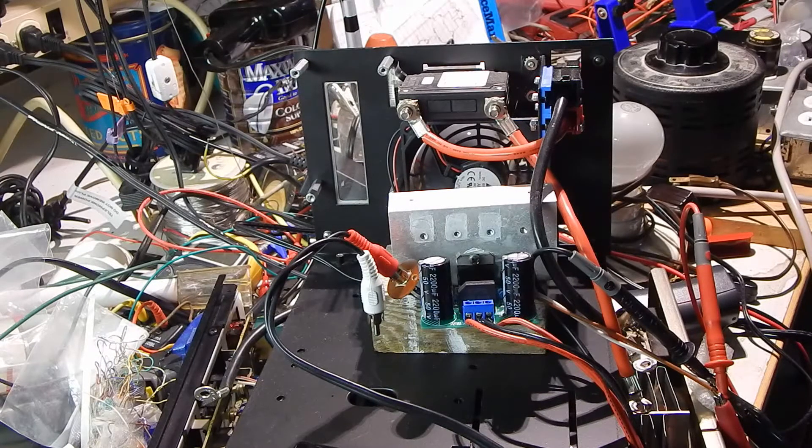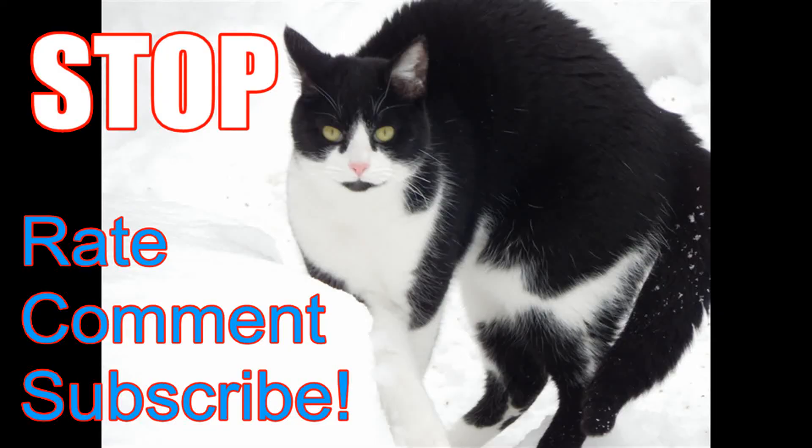That's what I get for not building that preamp project yet - need to do what John did and build a little test bench preamp for cases like this. But the amp held up well - it held up under duress, seeing almost 100 volts. So this chip is actually genuine and actually acts genuine. I don't know what happened with the other kits I had, but neither one of those worked over about 30 volts - this is taking the full monty. I could probably boost it a little past 100 volts using the Variac in boost mode. These modules work - three for a little over 12 bucks. Hell of a deal.